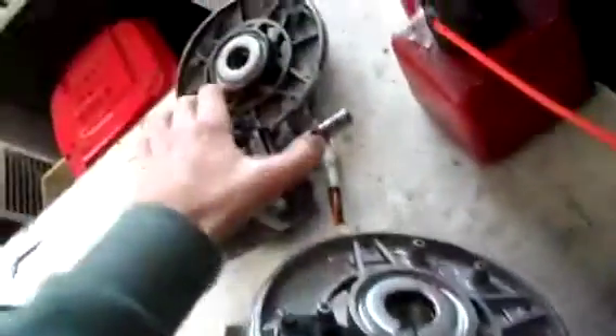The other side's a little bit dirty and a little bit of grease on it, but other than that it's looking good. Next step is to clean up all this dirt on the end bells, the rotor and the centrifugal switch, which still works alright. I'll give it another grease as part of maintenance, but it should be alright to go. I've also discovered that RP7 or WD-40 works really well at getting the grease off — you spray a bit on a rag and just wipe over it several times until it comes off. It doesn't hurt the windings at all, it's non-conductive, which is the important thing, and it works well.